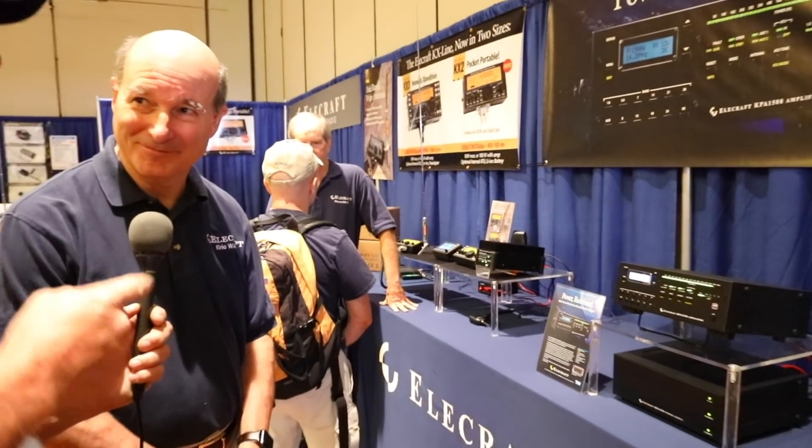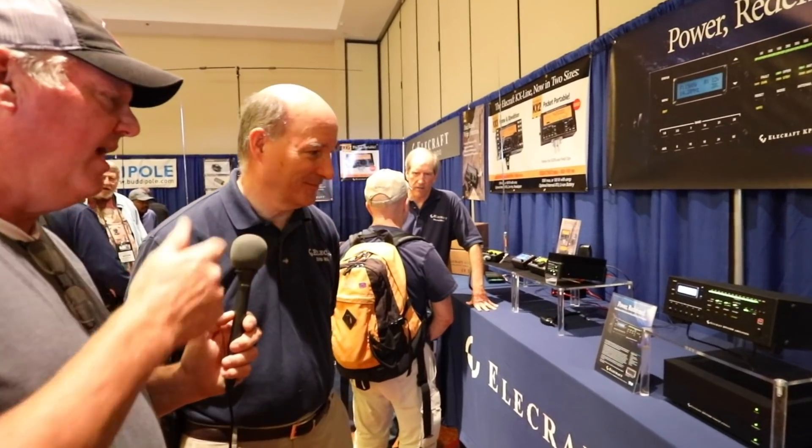So you get the person that wants to buy that amplifier but says, hey, I have a 50 amp power supply sitting under there — can they use a conventional power supply? No, you need to use this power supply. It's specific to the amplifier. It's a three kilowatt plus power supply because your input power is always roughly double what your output power is. It's a super high reliability switching power supply that's used for commercial server farms, then modified by us for quietness on both fans and RF noise. It's about 50 plus volts at 63 to 64 amps.